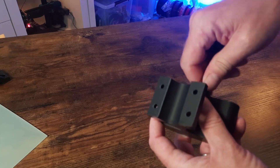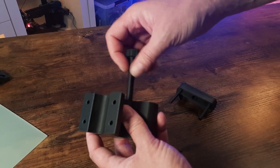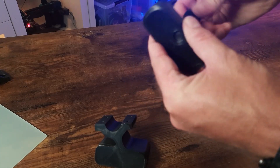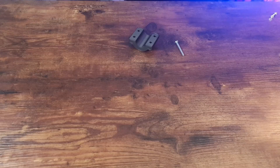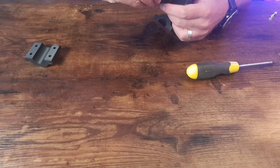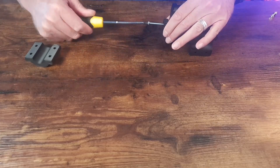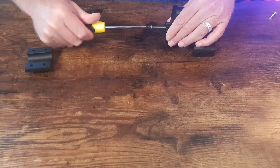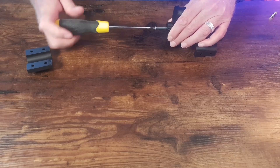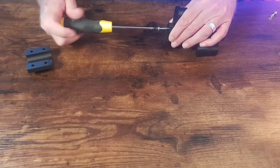Let's check if I can screw it in — the thread is fine, works perfectly, it does fit. Moving to the pre-assembly: a long screw is turned into the plastic screw in order to give the plastic more stability and breakage resistance. Since this was printed on the Z-axis upwards, a certain breaking point automatically arises at that height. Such a screw inserted within the plastic is an incredible increase in the overall stability of this component.